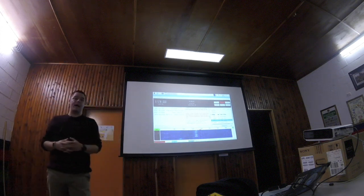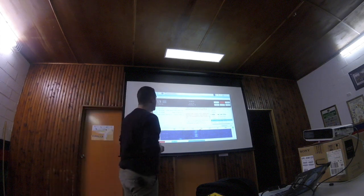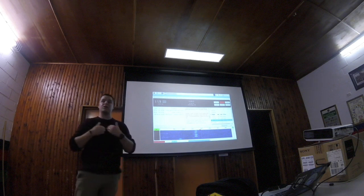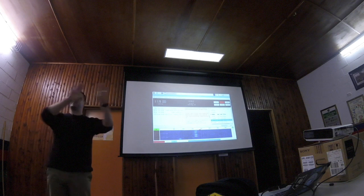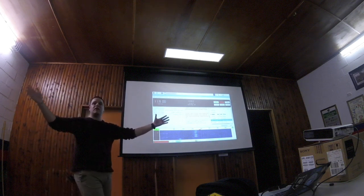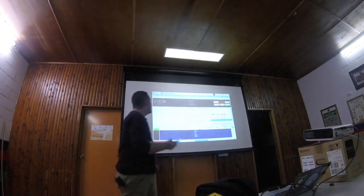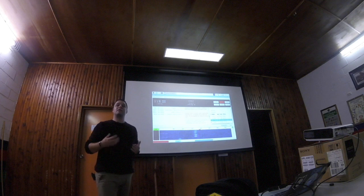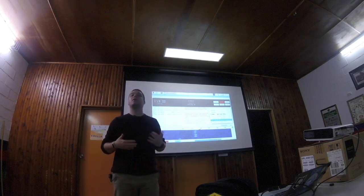Duplex, half duplex, what's going on? He's not sending to us, no. So while we are transmitting, it ignores everybody else. But while we're not doing that, it'll simultaneously decode, much like FT8 looking all across the window that you're listening, it'll just dump everything. Now, it's a little bit slow. So if someone's running something other than a Raspberry Pi at home, these things decode a little bit faster.